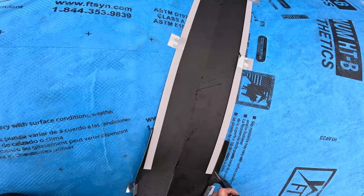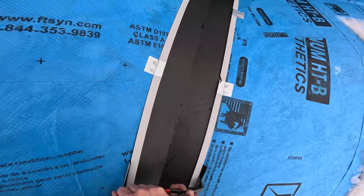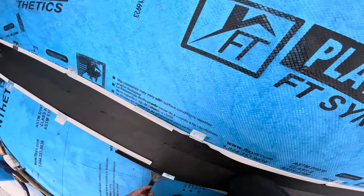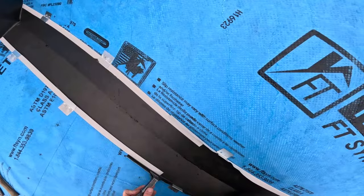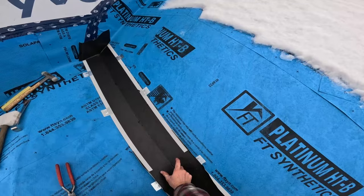and then I can transfer that back to its original position down there. And the metal will stretch. The metal will stretch. See that? Especially 26 gauge. Which is why, let's do this. See how I angle my folders back down to the original bending position? So what happens is if you just hammer them back tight, without this allowance that I'm giving it, these two bubble up. So this gets squeezed and this bubbles up.